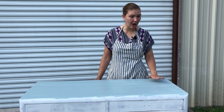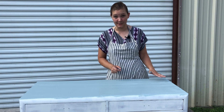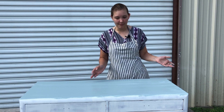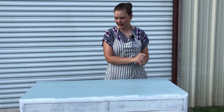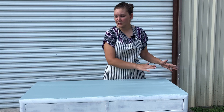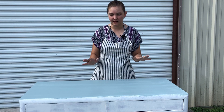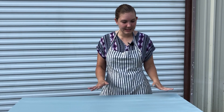I've paused painting for a moment. That spot on top where the veneer was damaged — I sanded it all down smooth, but it has bled through my primer. I used the bin shellac-based primer, which normally does the job, but this was an open wound and apparently I should have put two coats over it. So I'm going to take my clear shellac — the wipe-on, paint-on can version — and do the entire top just so it's even all the way across, and then I'll be able to paint right over that. Maybe I'll do two coats because I really don't want to deal with that again. I want to get the rest of the desk painted and then I'll shellac the top once it's properly dried.